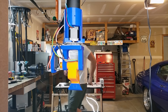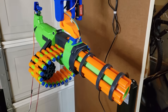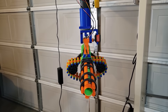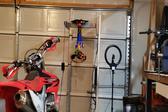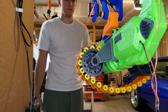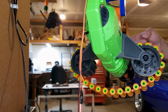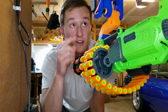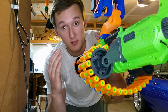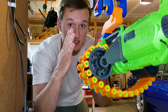After soldering this board for 17 hours and assembling all of this garbage together, it was time to enter a lovely phase known as integration hell. It actually started off pretty well — besides forgetting to plug in my stepper motor, the thermal camera was tracking me very closely from a good distance. But once I attached the blaster, for some reason it would track me and then get stuck in a position. It could sweep side to side looking for me just fine, but as soon as it tried tracking me, it glitched out. After 3,000 steps walking back and forth like an idiot, I thought I realized the issue: it's skipping steps on the motor, so the max and min angle keeps shortening every time it skips.